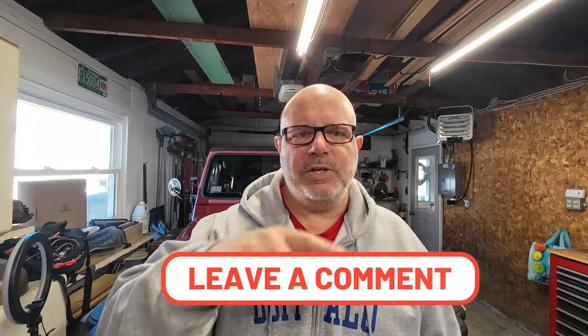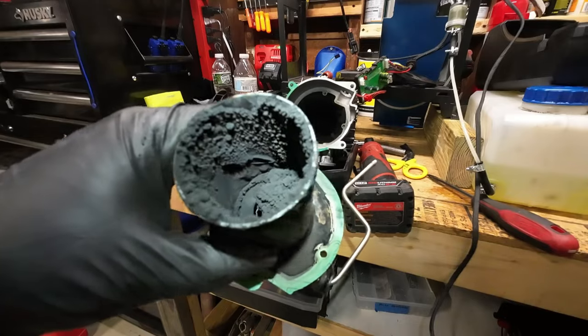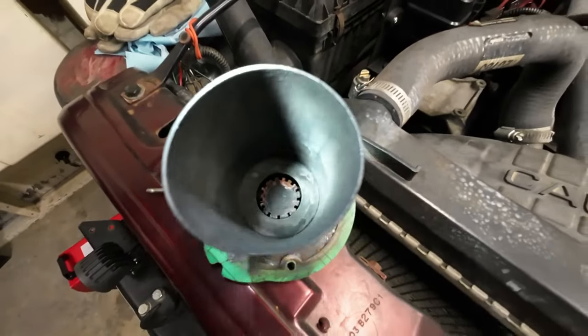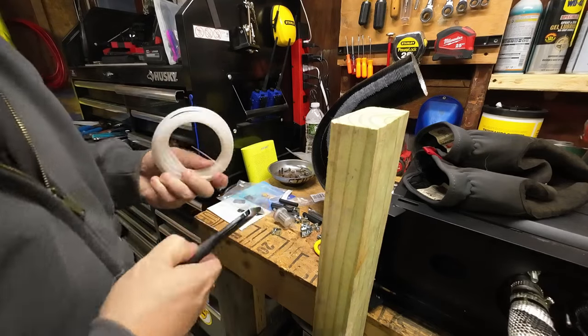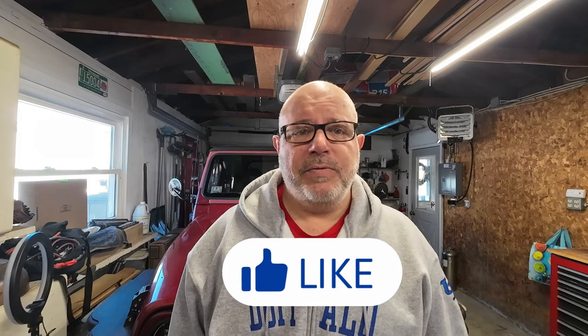This is my second winter with this diesel heater and it's been pretty much problem free, except right after my initial installation I had a loop in the exhaust, and what happened is it trapped a lot of moisture and I built up a lot of carbon. So I had to take the unit all apart, clean it out, and put it back together — and it's been fine ever since. The only upgrade I did while I had it apart was upgrading the fuel line from that green rubber hose that comes with the unit to a white plastic hose. I'm not sure if that made an improvement, but it sure seems like it runs a little bit better — maybe it's all in my head. But so far it's been a pretty good unit.